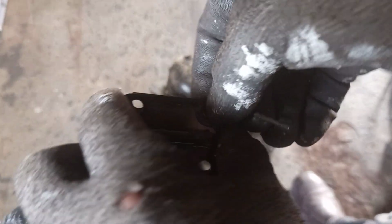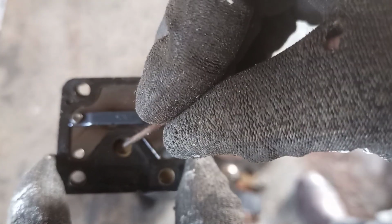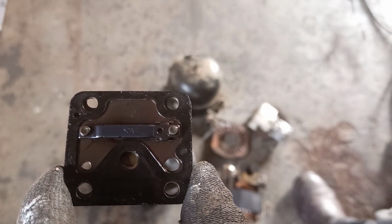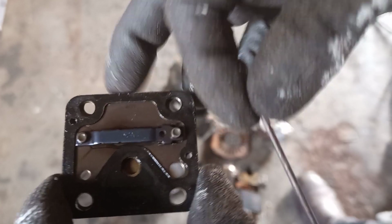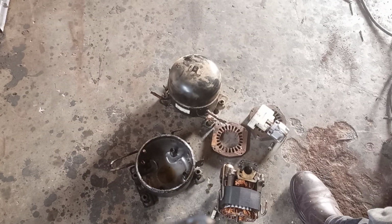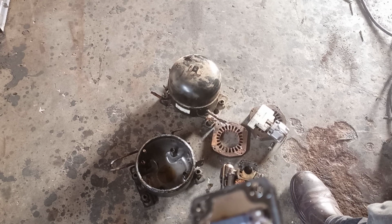So what have we learned is that when the compressor piston goes back, it will suck through this hole, but close this hole. When it comes forward, it will close that hole. It's not aligned because I'm holding it with my hands. It will close there, and it will open here, so it will discharge. So that is how a compressor sucks and discharges. That will be a topic for another day. Where does that help us in refrigeration?